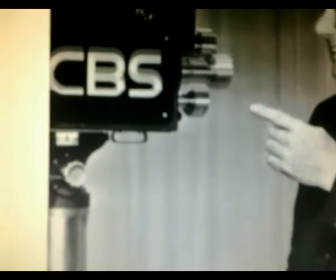Anyways, this is what they have. That's their black and white camera, which has a color wheel inside in front of the image orthicon tube, which spins at the appropriate rate to make the color fields. Here we are, here's an example. You can see that segmented wheel there is their color wheel, which has red, green, blue, and so forth, spinning at the appropriate rate in sync with the image pickup to make the color fields.